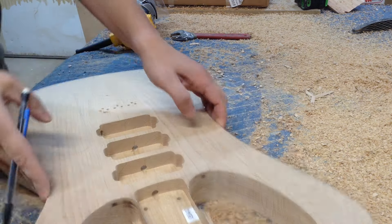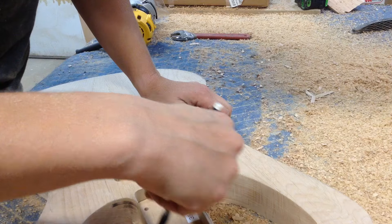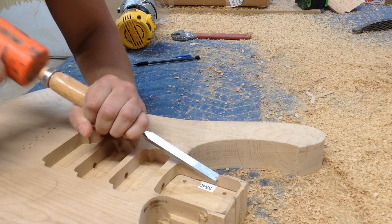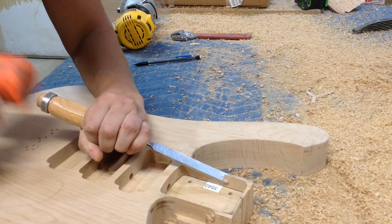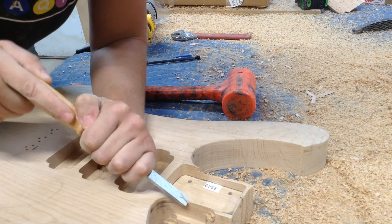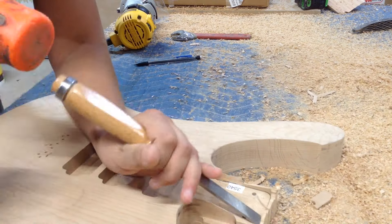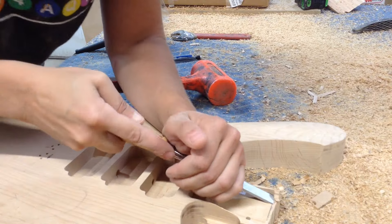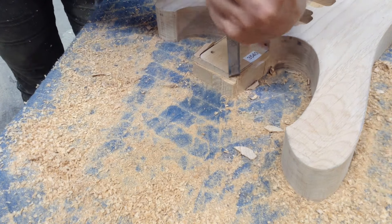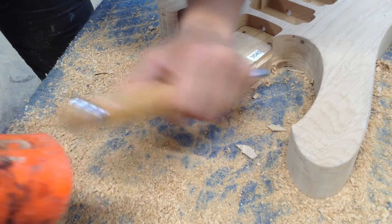So I lightly sanded that, and I was left with this area up at the top of the neck. He had told me not to cut too far into certain spots, and basically the recess that was pre-routed in here just needs to be followed. Because there's already a recess, I needed to make a plug for this section so I could route around it. This ended up working out well, because if the pattern had gone all the way to the top, the wood is so thin there that the ball bearing would have busted through the wood anyway and hit the pattern.